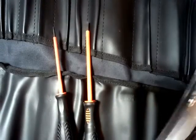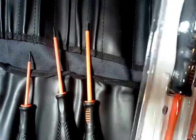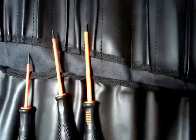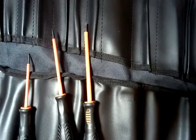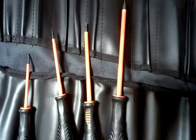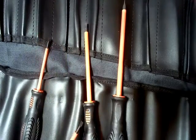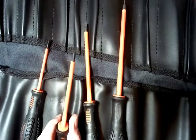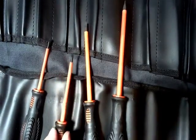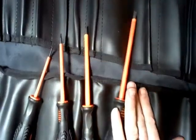Let's pull all the flathead screwdrivers out and take a look at them. These are electrician certified — I'm not sure who certified them, it doesn't appear to be OSHA or any U.S. regulatory body — but they look very much like the 1000-volt screwdrivers that have insulation on the shafts. It says it's good for 1000 volts and it kind of looks like it might be. The grip is pretty solid, not sticky and nasty. The tips are great for electrical work in control panels because they don't have the flare — they're straight shank tips which can go right into terminal blocks and turn relatively small screws. There's a number one, number two, what looks like a three-eighths, and a big heavy-duty quarter-inch.